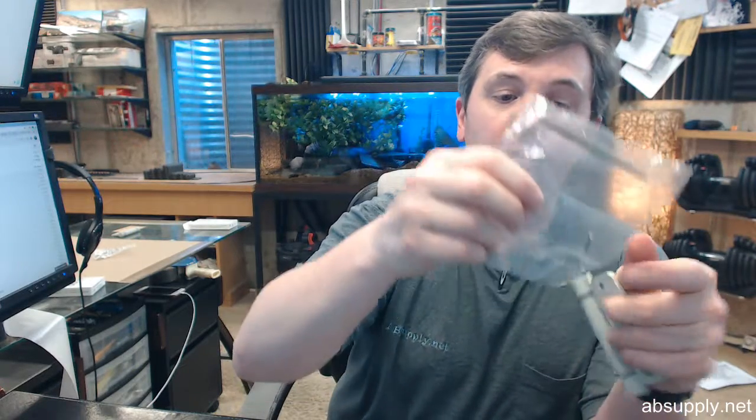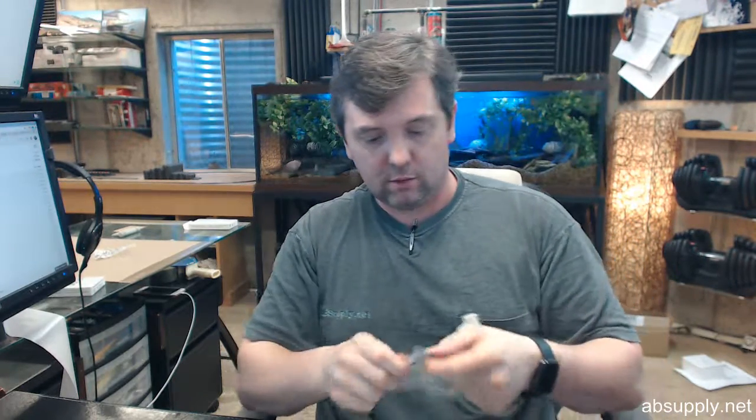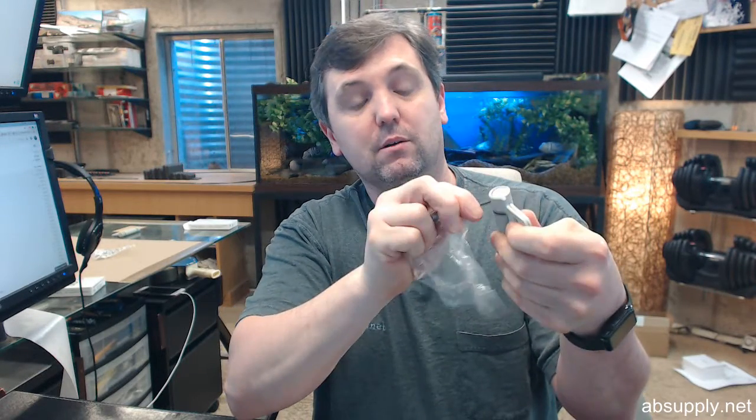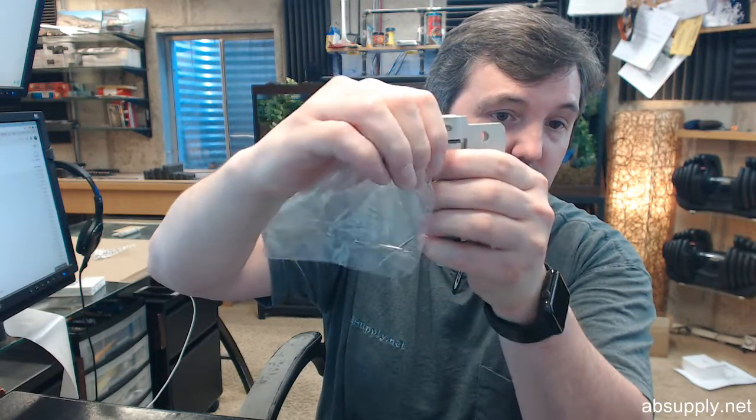Every hinge that you order will have a tension pin, that silver pin. Into one of those holes at the top, insert the tension rod and turn it clockwise. As you turn it clockwise, it will reveal new additional holes, and into one of those new holes is where you'll set your tension pin. You'll install your spring hinges in the middle and bottom before going to the top. The top will always be the last place to put a spring hinge.